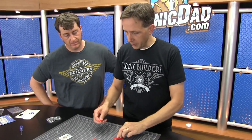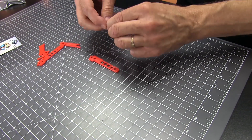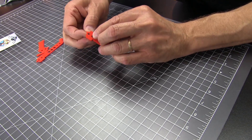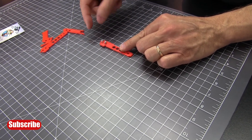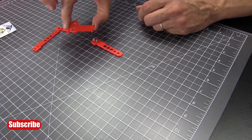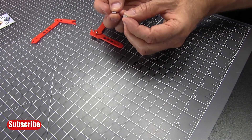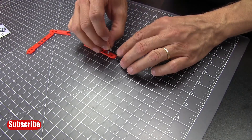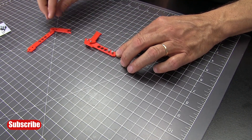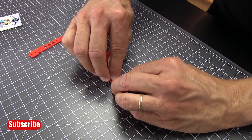You can use the instructions to help identify the plastic parts. We're going to start with the rail, which is part number one. You can see the grooves in the side — place that down on your work surface. Then take the standoffs and fish them through the back like that, with the grooves down and the screw heads on the bottom. Now take the grip piece and slide that over those two hex standoffs. Then we'll take the next two standoffs — these do not have screws yet — and put those in these two features right here. And then this is our centerpiece, and that fits over the standoffs just like that.